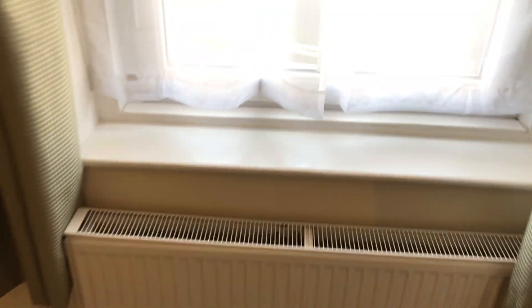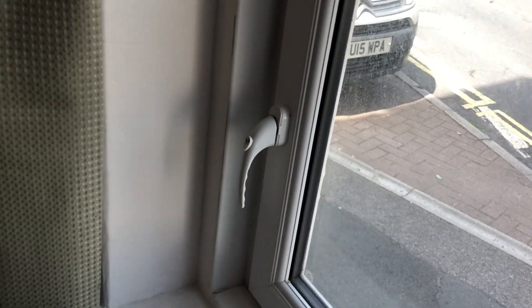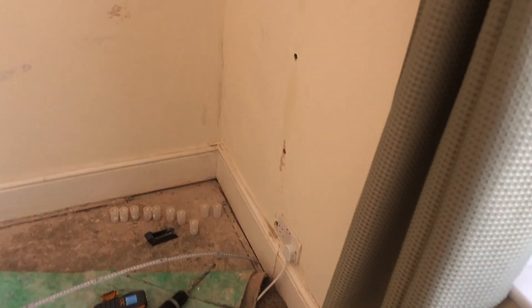There's a lot of staining on the chimney. You can see a lot of rusty angle bead. Again, a lot of damp down here. If you just look here, you can see the ground level difference — you can actually visually see it is higher. It's only about 4cm higher from there, and probably about 6-7cm below ground when you get down to here.